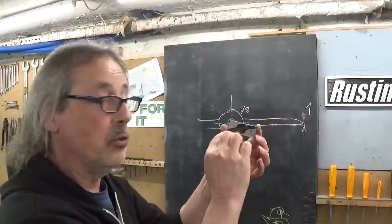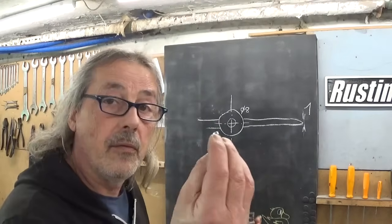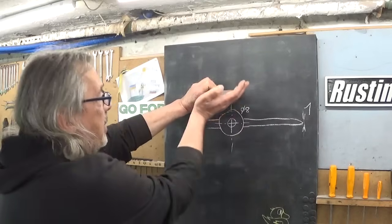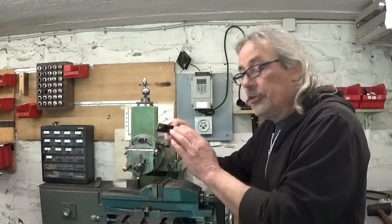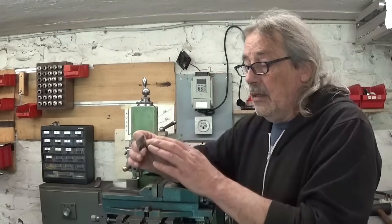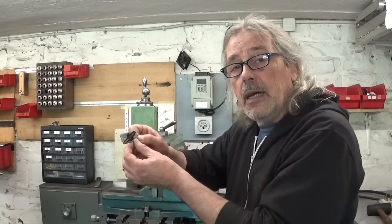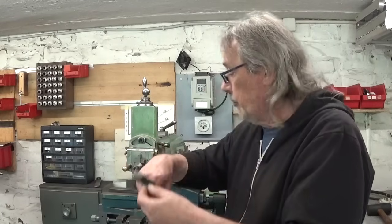If I use this piece of leftover scrap and make a pocket to hold the part — first I'll cut off one side, make it to size, then bolt it. I have one cute little bolt I can use. It's pushed against the side of the pocket, then I can mill the other side. To rough it out first I think the shape will make a quick job. It's a little too small for the belt sander — the belt sander would be faster but I don't know how to hold it and it's going to get really hot.